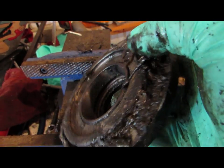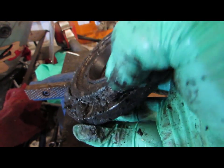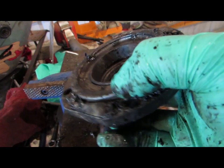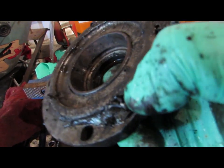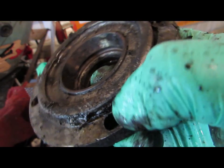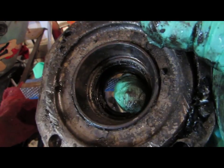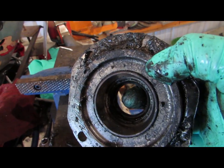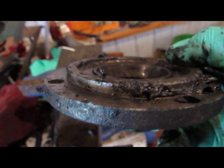See this crusty plastic on the side? Those are actually shims. You've got to shim these caps to make the clearance correct in between the gears, and I forgot to take these shims off. So I hope that I have some laying around somewhere. Sorry this one failed but it has worked for me in the past.